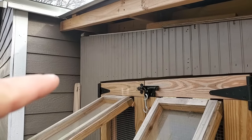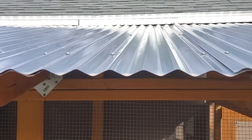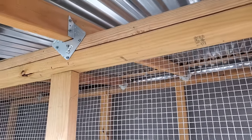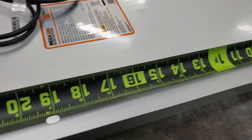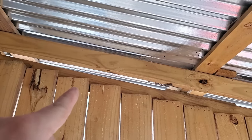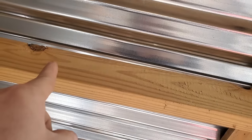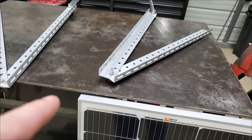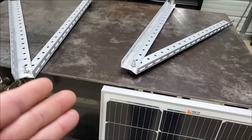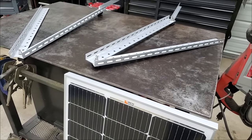On the back of the solar panel I'm going to mount it right here and right here — from this hole to that hole it's 19 inches. So from the outside we're going to install a new board wherever 19 inches falls. I think I'm going to bolt the solar panels to the brackets first, get them good and secure, then lift them up onto the roof and bolt them down. Doing it this way will keep everything nice and straight, because I'm doing it by myself and that ain't easy.